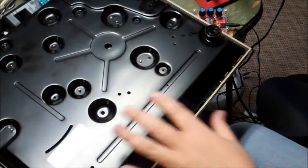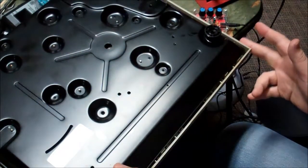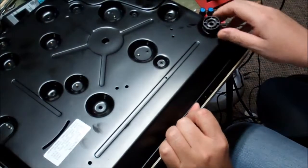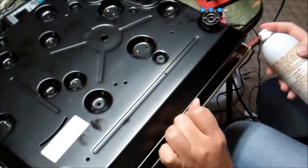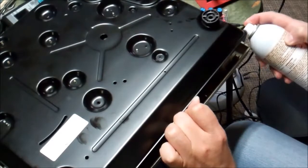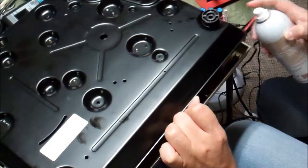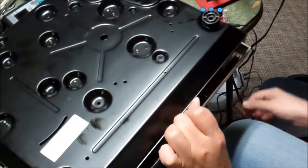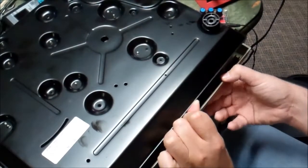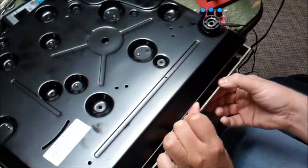So my fears are confirmed — you have to take the arm off. The motor and all this stuff is lifted there, and this plastic deck sits on top of this mess. But if I'm careful and I can just lift this just a little bit, I can actually see where I can snake the straw to my contact cleaner back here. And I should be able to get that in the pot from there, then hopefully manipulate this and get it to loosen up. If that's what it needs and we don't have to tear this all down, that will be a good day.